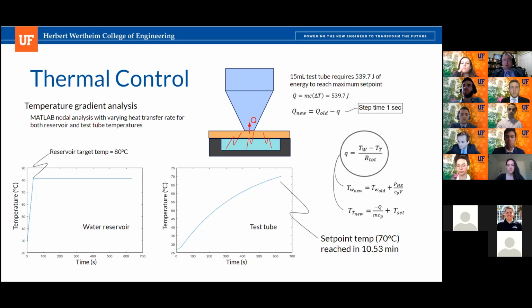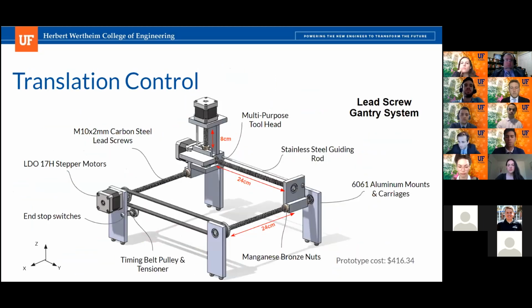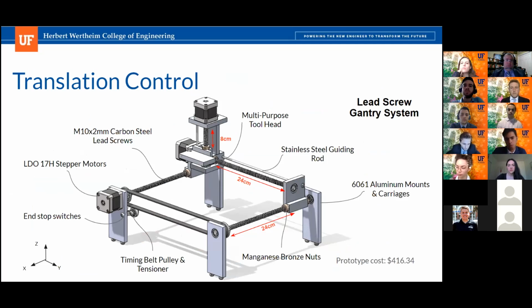Couple here. So I was looking at your XY motion system, and since you don't have a linear bearing or anything on the x-axis, if I was looking at the picture correctly, do you think that the lead screws alone will provide your system enough constraint and rigidity without the linear bearings?